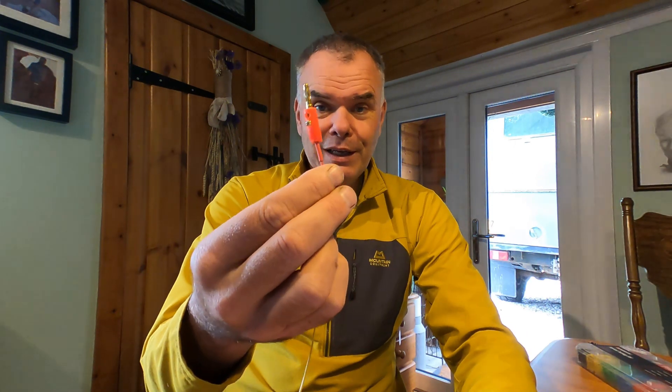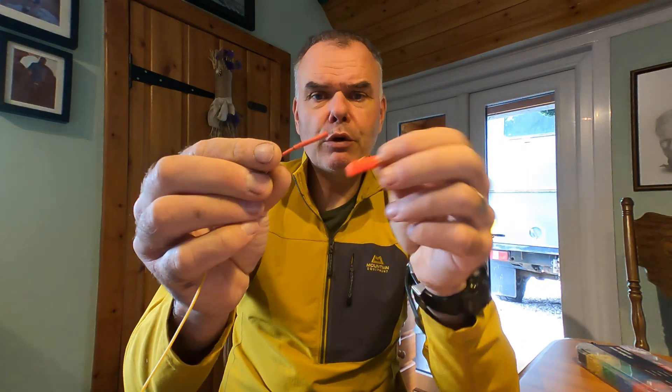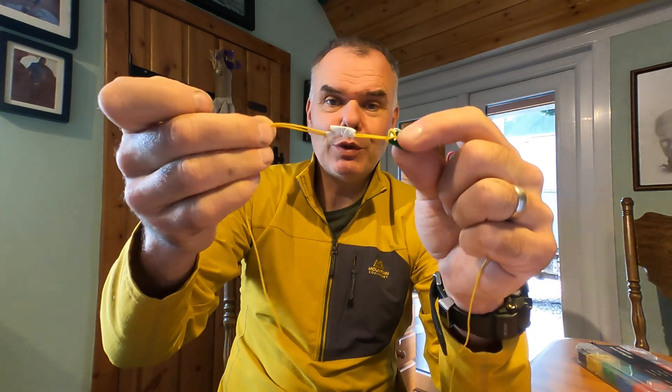So how did I make the actual radiating wire? The first end is dead simple — it's a wire connected into a banana plug. This is your 18 feet or 5.5 metres of wire. What I tend to do is just solder the end up to make a solid connection, then add a couple of bits of heat shrink to give it a bit of strength, because by soldering you're introducing a fragile weak point, and then it's simply screwed down into the banana plug. The other end of this wire I just simply looped through the SOTA Beams antenna mount — that's a lark's foot. I haven't even finished this off yet because I thought I'd better test it in case I needed to adjust it, so it's secured with tape for now. I'll cut that back and put a bit of heat shrink on there as well. And that's your radiating wire sorted.